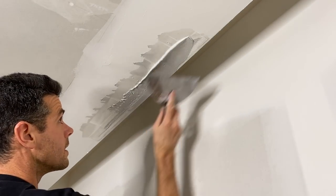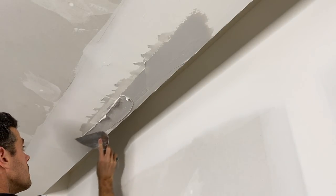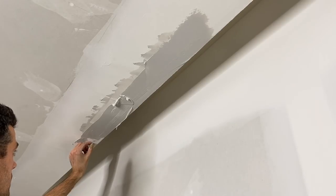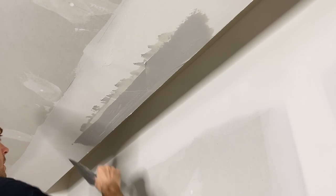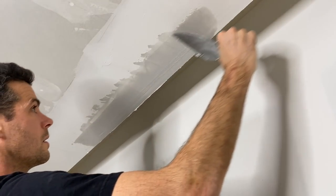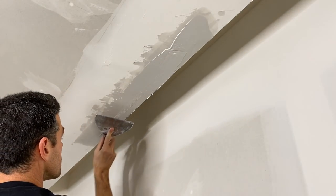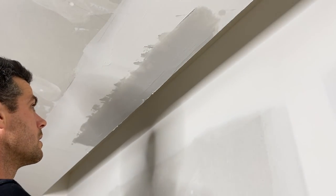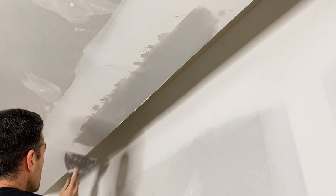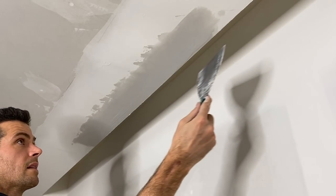Now it's just as simple as coating it out. Loose strand — hate those. I'm also going to build it up just a little bit, so there's a little bit of mud hiding the tape. We'll let that set up before we finish coat it. But that's pretty much it right there. Now that's hidden, buried under some strong mud — should be pretty good.